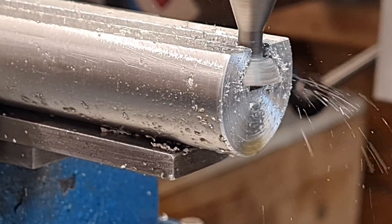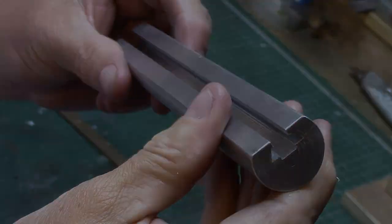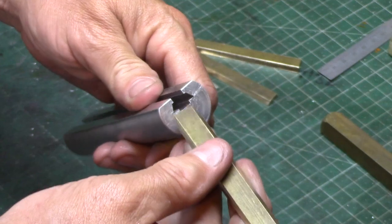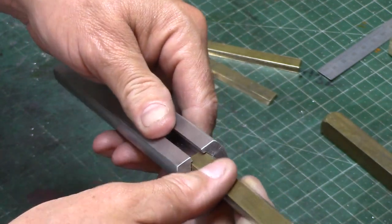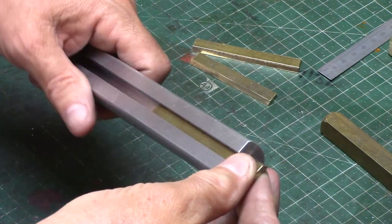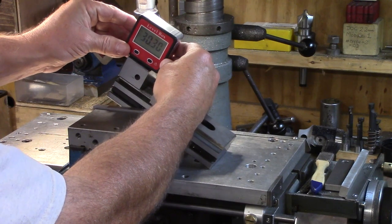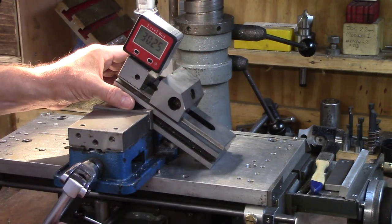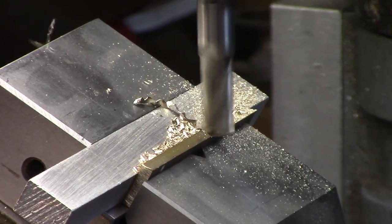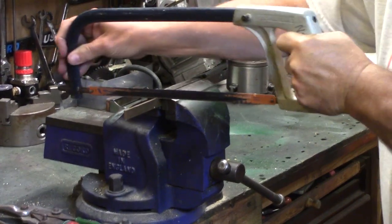This dovetail slot allows the connection of the headstock, tailstock, and the carriage by using a matching dovetail, whilst allowing the tailstock and carriage to be able to slide along the bedways. I started off videoing some of the machining operations, but as the build progressed I simply got too involved with the process — filming everything was going to become a bit of a distraction, so I didn't detail much of the rest of the build on video.